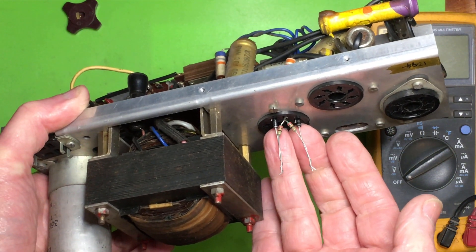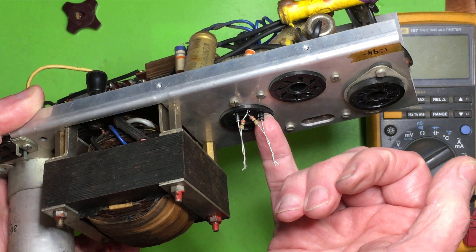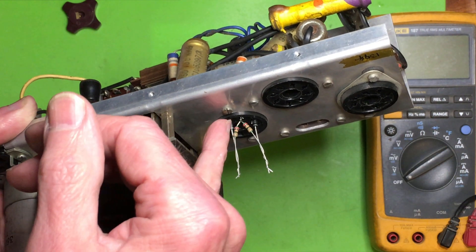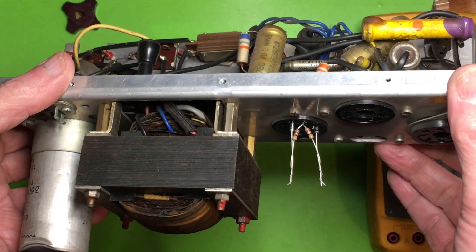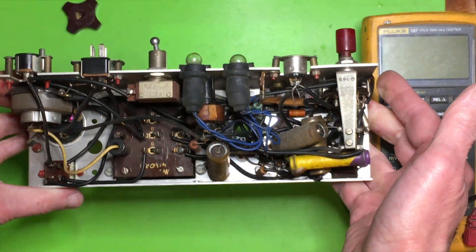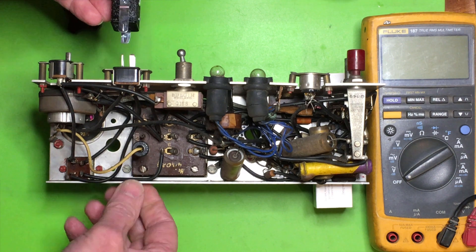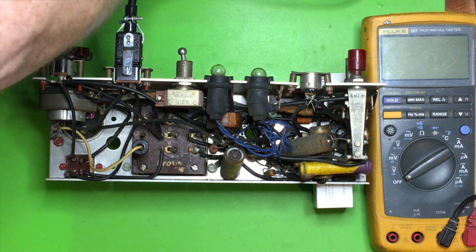That's the temporary rectifier setup — it's two 1N4007 diodes, one on each side from the valve pins that come from the transformer windings, feeding two 330k resistors twisted together and into the cathode pin position, which goes to the main smoothing capacitor. When powered up it'll put at most one milliamp through the rectifiers and charge the capacitor. The next thing is to see if it actually charges — I'll get the bottom back in the stand, reconnect it, plug it in, and again see what happens.